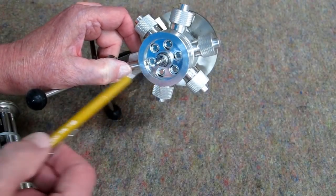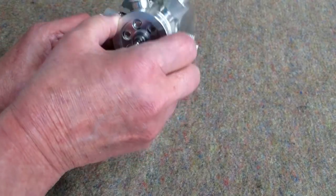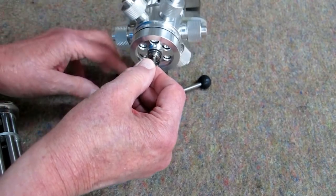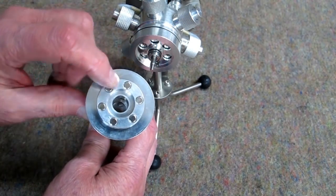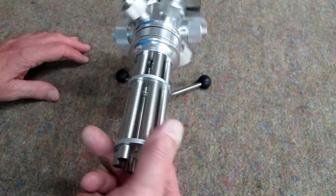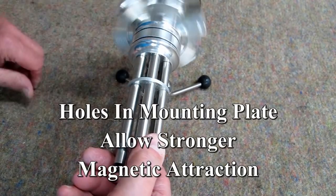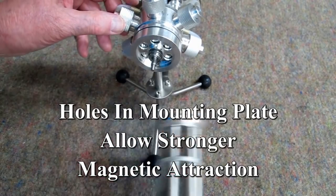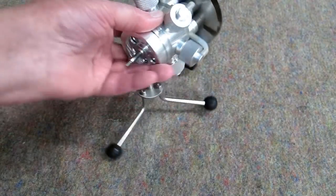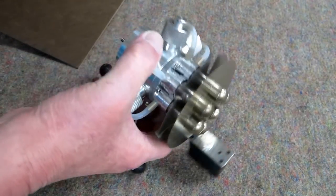There are six magnets in here, and the holes are cut into this aluminum ring — this ring is just a mounting plate that holds the axle for the cylinders. This end of the Gatling gun has six more magnets in it, and it's just magnetic coupling. It will actually spin independent of this piece. Just for fun, I'm going to try and fire this up without that Gatling gun attached to it.